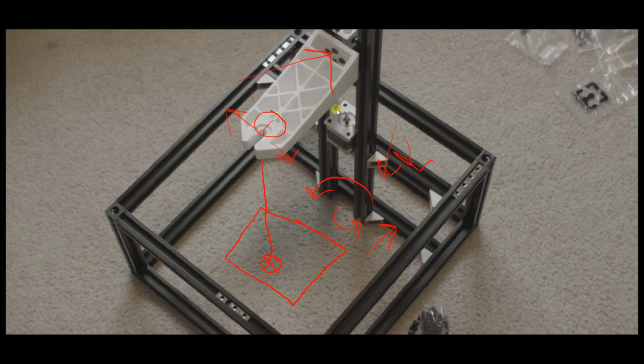down, and make sure as it goes up and down, try and roll most of the axis. So for example, from here, which is the build platform, go almost to the top out here where you can't see, and make sure that this plumb line doesn't move. So you want to make sure that this weight is constantly centered over your crosshair down here that you wrote on your piece of paper, and obviously you might want to tape the paper as well so it can't move.